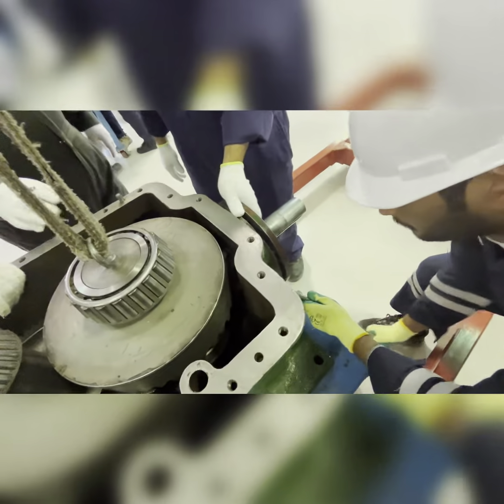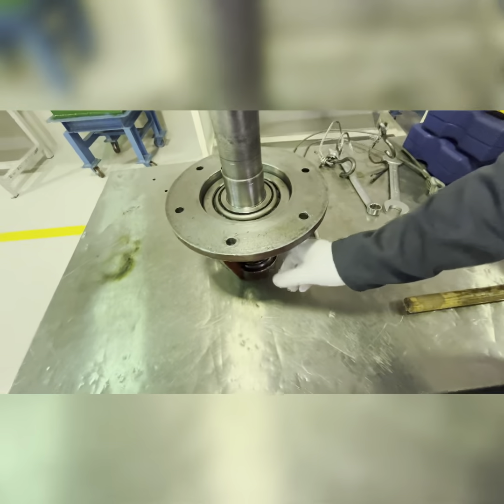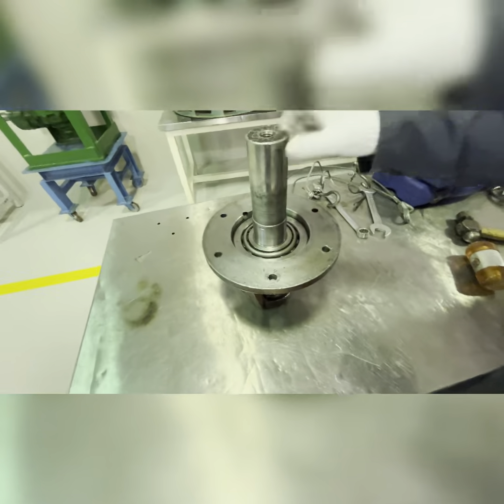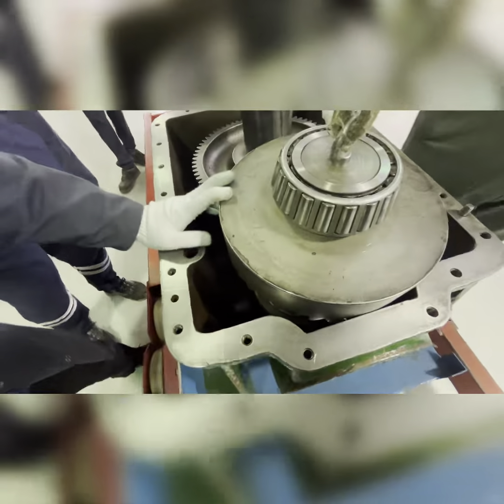Together, lift these two gears — they are also holding this one. Make sure the gears don't touch each other. We have the input shaft, then the pinion or driver, the intermediate gear, the driven gear, then the output shaft.